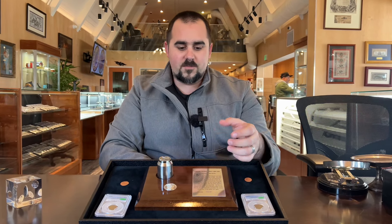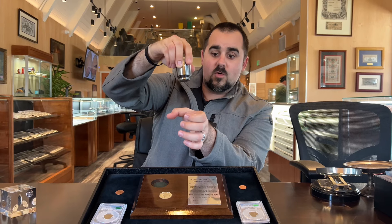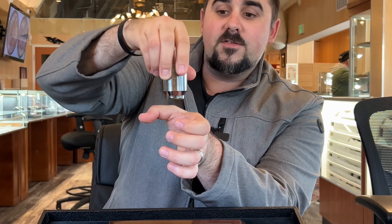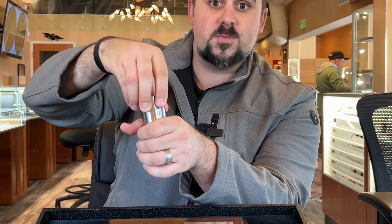They're going to make multiple dies in order to fill the entire mintage. Each die can probably make somewhere around 50 to 100,000 coins — feel free to comment below if you know that number. Where you will start seeing die varieties: let's say they made 10 dies for the mintage run, but on the third die, when they're pressing the die down into the master hub, maybe the hub shifted a little, or there was some kind of variation that allowed the die and the hub to shift in the creation process, which created some doubling. That's where double dies come from.